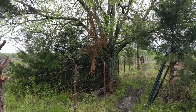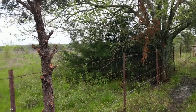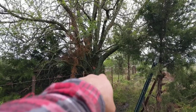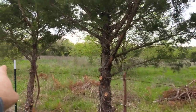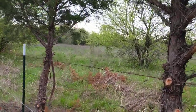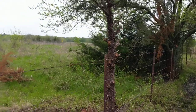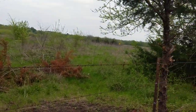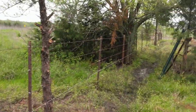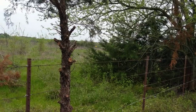I was watching on YouTube today a guy installing pipe corrals and he mentioned this casually — it just clicked. When he puts his posts, he levels every fifth post to the height he wants. So let's say 52 inches here, then go one, two, three, four, five, and mark that one at 52 inches too. When you clip it at 52 inches, the line between those two posts is straight. It doesn't matter what the terrain does in between — you just clip the intermediate tee posts where the line is.